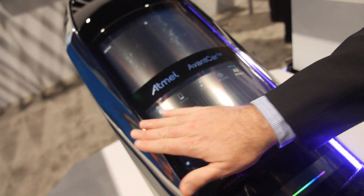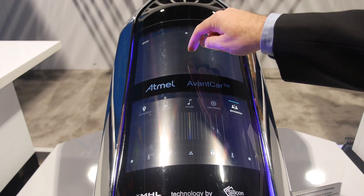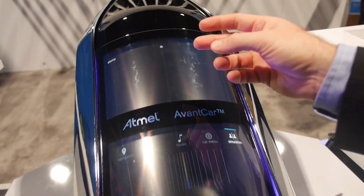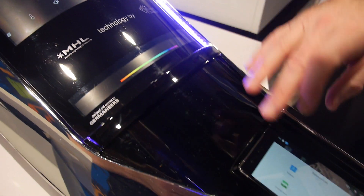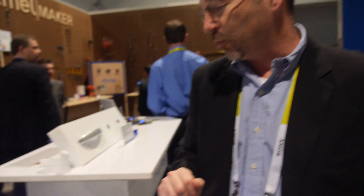So there's lots of sensing going on here. What does Atmel do in here? We have multiple products: LED lighting, the metal mesh on the sensing side, the Qtouch sensor, and the MaxTouch processor on the curved display. Qtouch on button slider wheels. We have Ethernet AVB — when you turn on the audio and stream it, you can do that over Ethernet now. And also our LIN/CAN transceiver products and security.